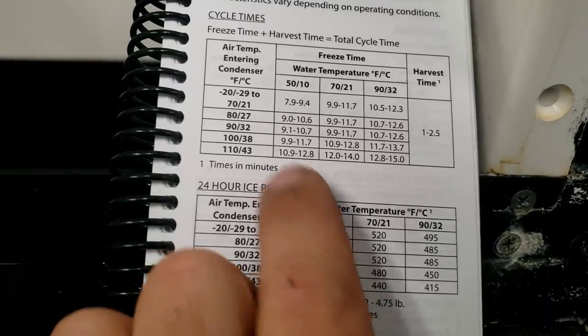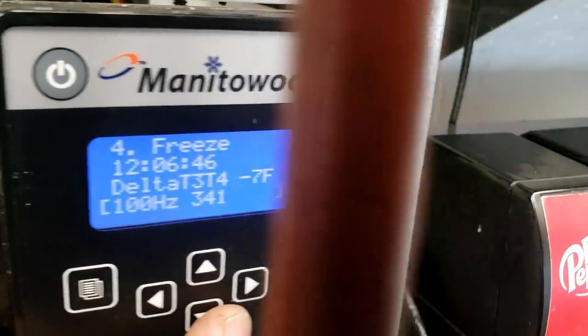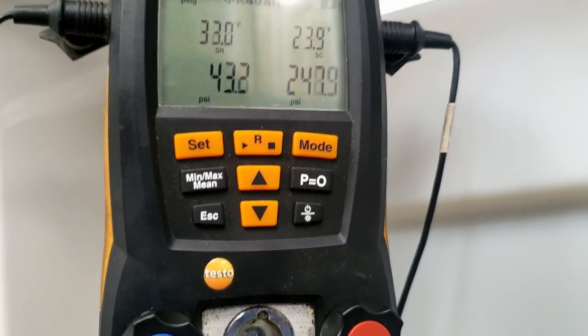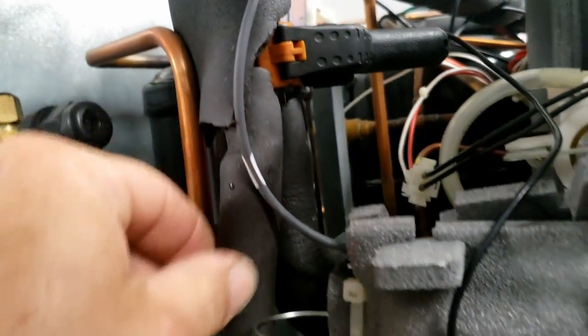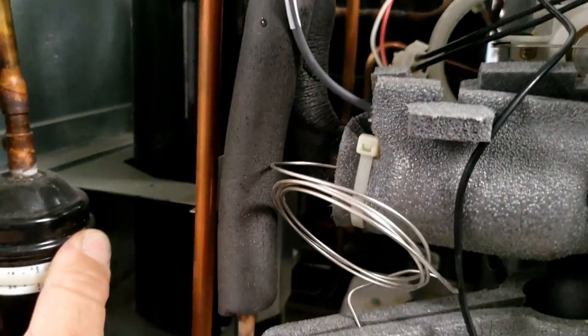We're just going to watch it and see how long it takes to freeze — should be right around 10 minutes. Our Delta T across that coil is starting to lose track, which tells me we might be a little low. There's a good chance it might be a little low — we may add a pound or two. Superheat on this is running about 33 degrees. We're coming out at the sensing bulb there's our TXV — getting the reading before the liquid line combines so we don't throw off our readings. Everything leads me to think it might just be a little bit low.